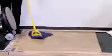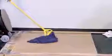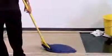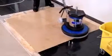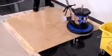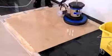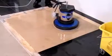5.8. Now we're going to put the 3000 in it, and this is where you should really see a noticeable difference to the gloss. Once again, we're putting enough water on the floor to lubricate. For your 800 and 1500, you use a little more water, and for your 3000, use a little less water, but once again, you don't want it to dry out. We're going to take our time and go over this very slowly, 8 to 10 times, because this is the part that the customer is going to see, or that you're going to see.